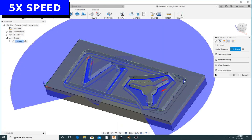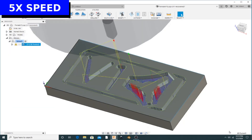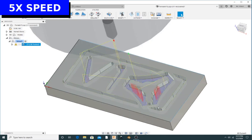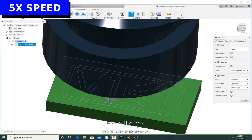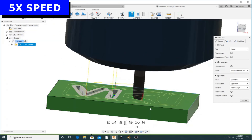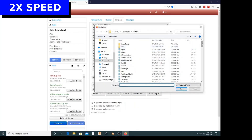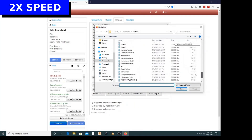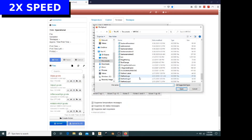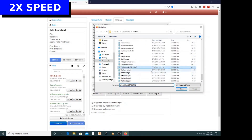On the female part we're not going to leave any stock. On the male part I left 0.1mm in the radial plane but nothing in the axial plane, so I set that to 0. On the male part, when I imported the SVG I just flipped it on the horizontal plane so we get it in reverse. I created a very similar model and made the pieces stand out that I wanted to fill in the female part, so it's kind of an inverse of the female part.